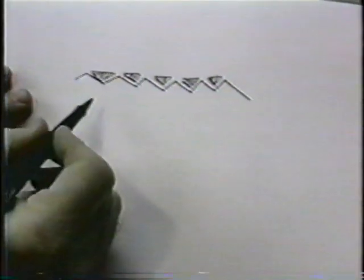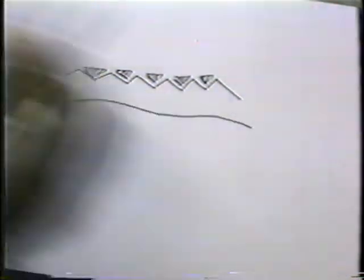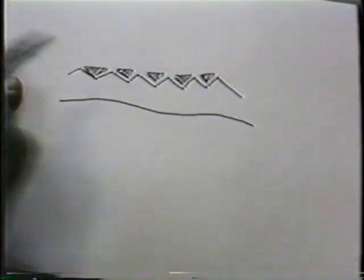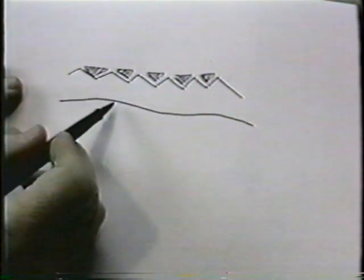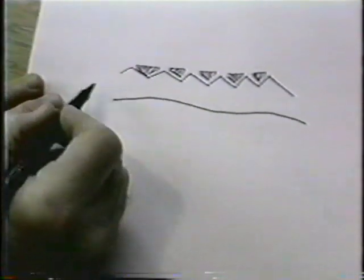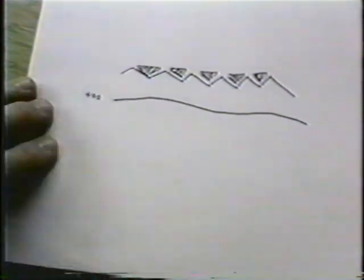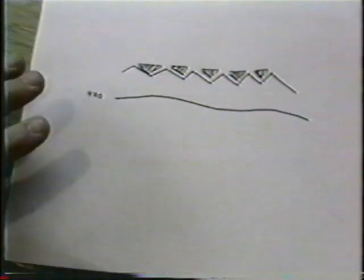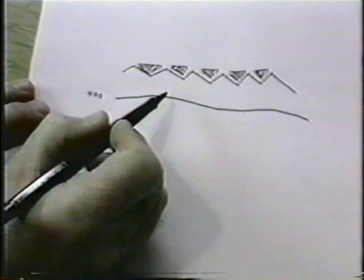All this is going to be extra weight, needless weight, and it's going to be considerable. So the first thing we want to do is get the wood, maybe not perfectly flat, but as flat as possible. We don't want to start with rough wood, grainy wood. We want to start with it as flat as possible. Now, let's say you sand it, the final sanding, you block sand it with 400. I'm going to go over block sanding, I'm going to go over sandpaper. The goal is to get the wood flat.